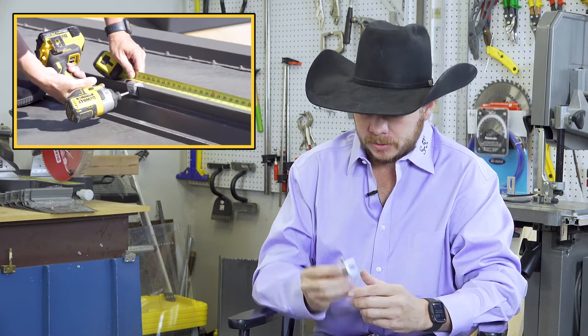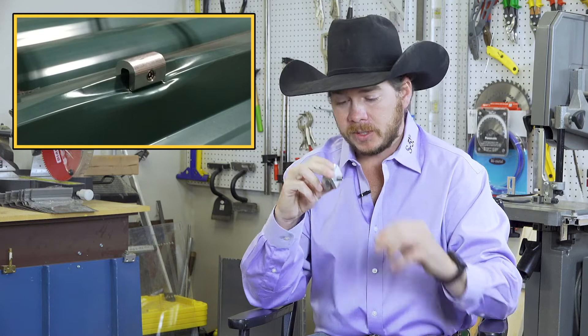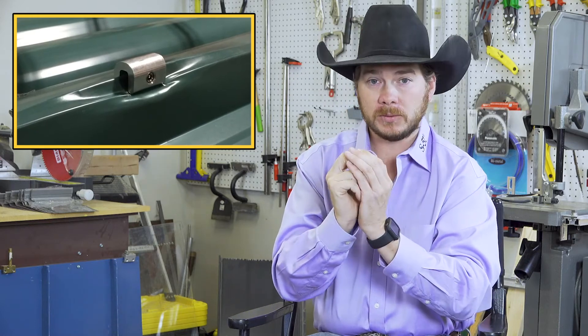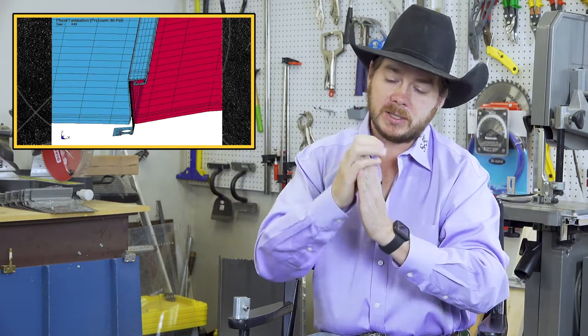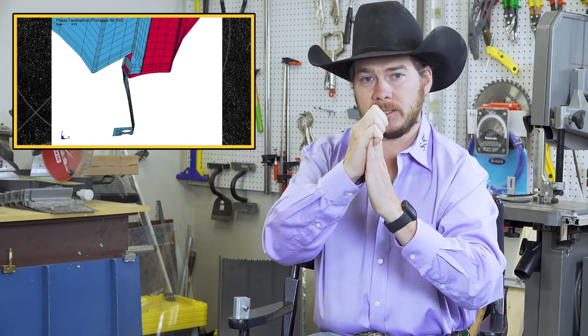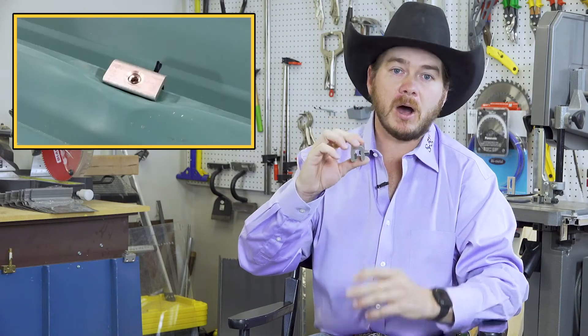A wind clamp is designed specifically for that roof so that it can nestle the folds under a high wind event, preventing a number of failure modes. The most common for a standing seam is that the panel will bellow. When that happens, the seam — which is wrapped up tightly — tries to unfold at the seam itself under high wind load. Placing a clamp directly on that seam holds it together and prevents that mode of failure.